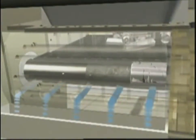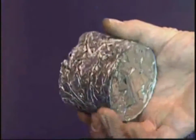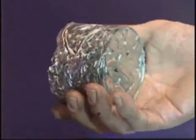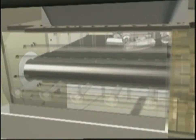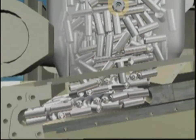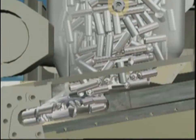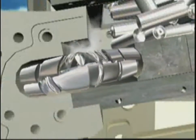The Stage 2 RAM then compacts the crushed cans using 15,000 PSI of pressure into a dense briquette with 98% of the liquid removed. The briquette is then pushed into an airlock and the densification cycle begins again until all the cans in the hopper have been processed. The HAZPAC is intrinsically safe through mechanical interlocks to prevent any escape of the propellant or liquid into the atmosphere.